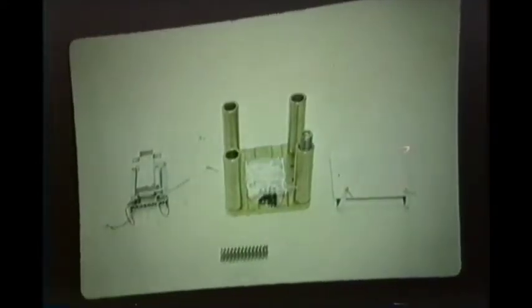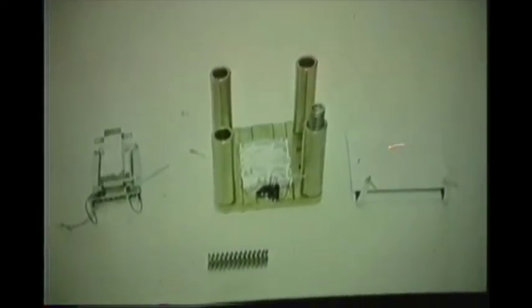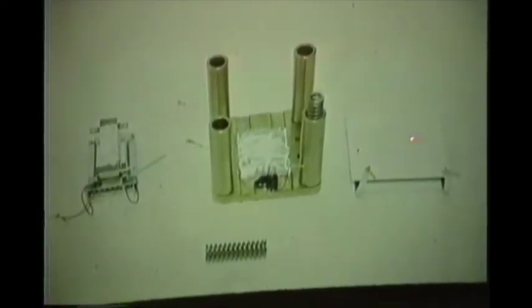So, take this apart a bit further. That over there is about 1.5 inches square, and that's the large thermoelectric cooler, which sits against the cooling jacket on the bottom of that chamber we saw a moment ago. This thing here sits on top of that, and in the middle there sits this stack, which has got three thermoelectric coolers stacked in stages on top. And the CCD chip goes right on top here.